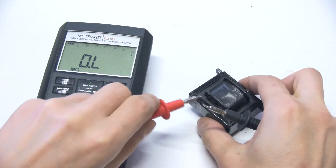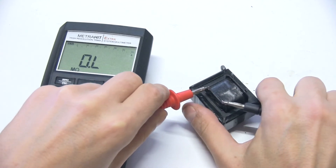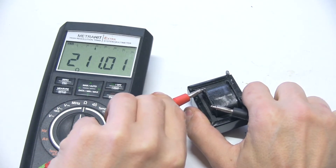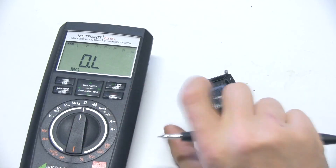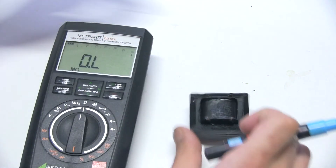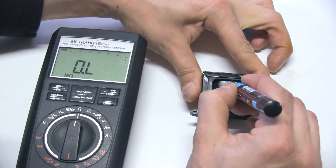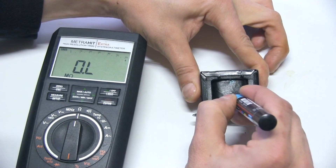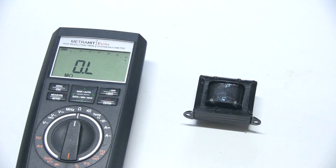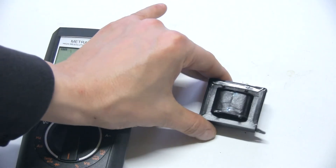On the other hand, on the other winding we have around 210 ohms. This is the thin wire side, and this is the primary of the transformer. One tool I like to use is Posca markers — they write on anything. So I'm going to write 'P' for primary and 'S' for secondary, so I know when I use this later on and don't have to measure it again.